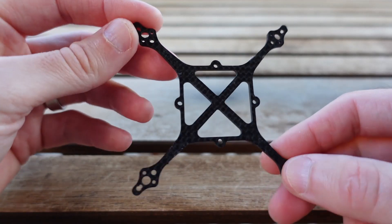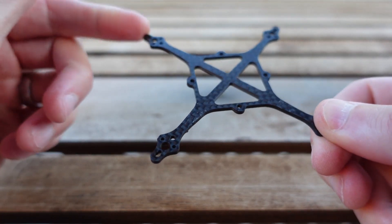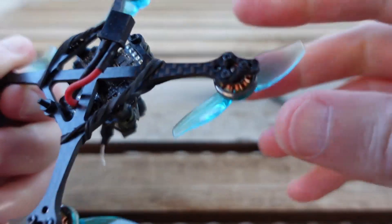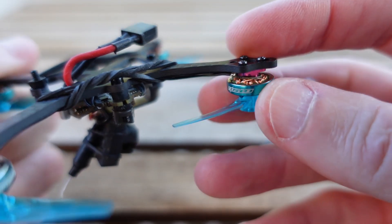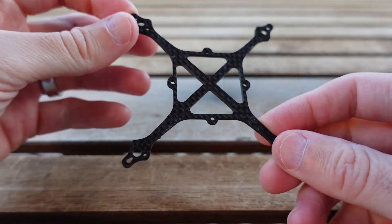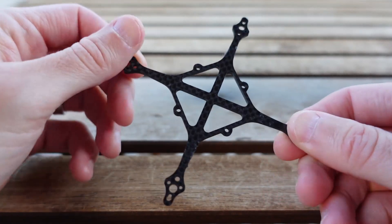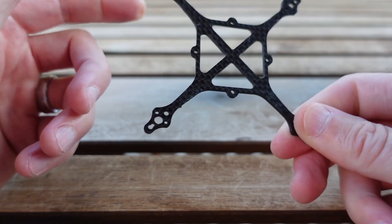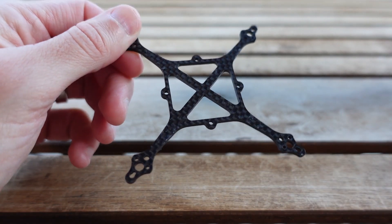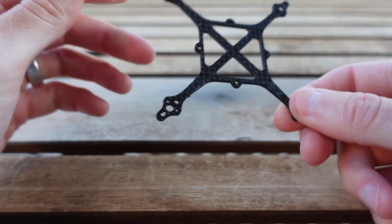Like all my frames, the Skyrider is intended to be a good balanced frame — robust enough for real use. The baseline frame is 1.5 millimeters, which works with regular M1.4 screws in the short length that comes with most whoop-size motors. I'm also offering it in 2 millimeters if you want more robustness to control vibrations from beat-up props or motors. For the 2 millimeter version you'll need 4 millimeter M1.4 screws, and I'll put an Amazon link below.